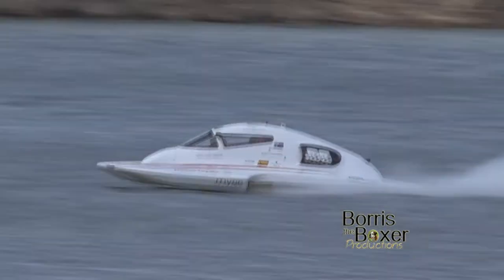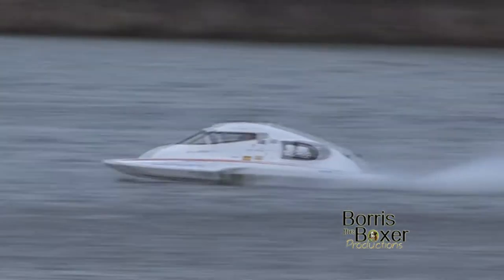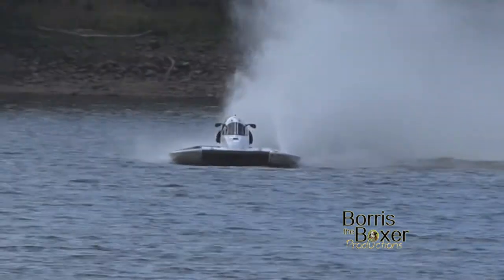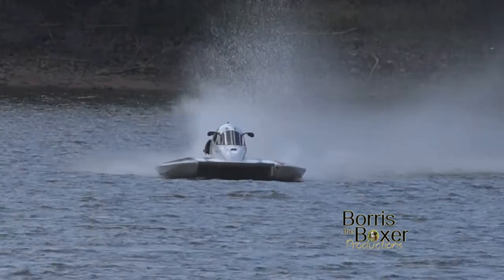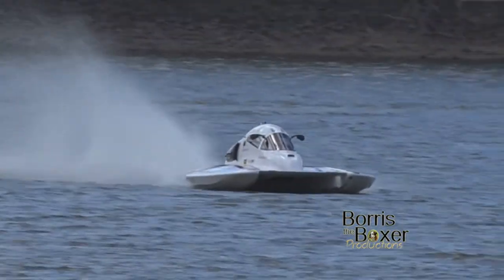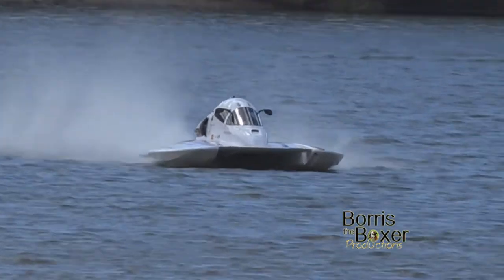That's the only reason they're able to turn so tight and so fast without sliding out or rolling over. In between those two front sponsons — the little pointy bits out the front left and right — there's a thing called a canard wing, C-A-N-A-R-D wing. That wing is adjusted by the driver either up or down, and it essentially flies the front of the boat. As they're coming into the wind they can get a certain amount of lift, and coming back down they can change that. Some boats have automated systems, some use manual systems — it depends on driver preference.